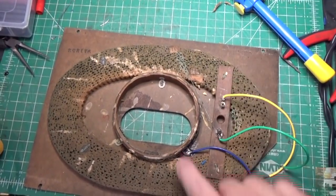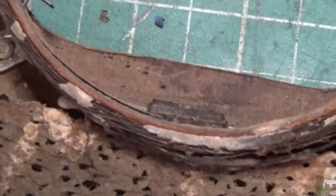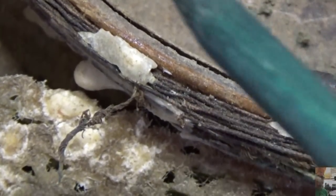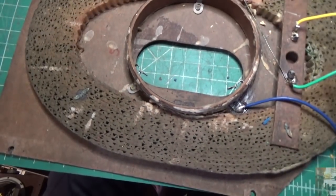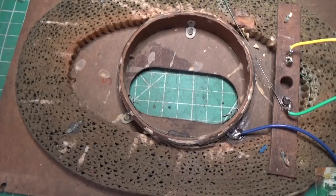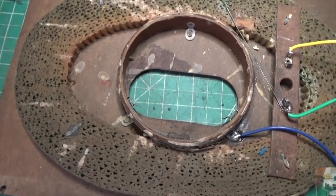I've got the new wires on, but I'm a little worried about this center loop. Looking closer — that looks to me like this coil is open. This is an antenna coil, I'm sure of that. I'm just not sure what kind of bearing that's going to have on the radio. That could be why someone soldered a different antenna wire on there — that big thick wire I removed from the yellow side. This coil may be bad. If it is I may have to rewind it. We'll cross that road when we get to it.